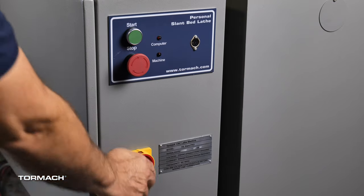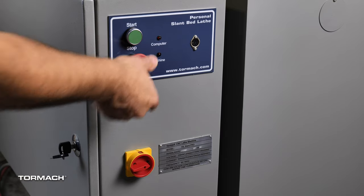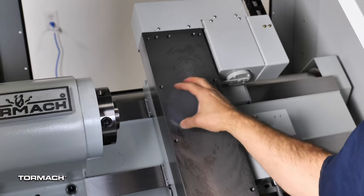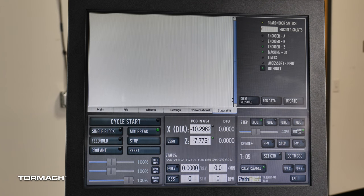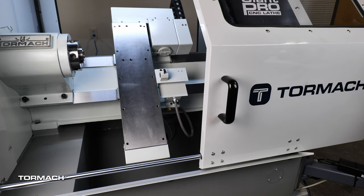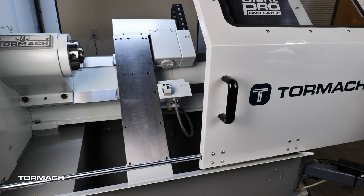At this point, if your lathe is off, you must power it on. Turn the main disconnect switch to on. After PathPilot boots up, turn the e-stop button clockwise to release it. Press the green start button and click Reset on the screen. This is a good point to stone off both the table on the lathe and the bottom of the turret — make sure both are free of burrs and any debris. From the PathPilot interface on the main tab, select Ref X and Ref Z to reference the machine. Since the engine hoist and turret have to navigate into the enclosure, jog the table closer to the opening, but make sure there's at least 5 inches of room to the spindle from the side of the table.